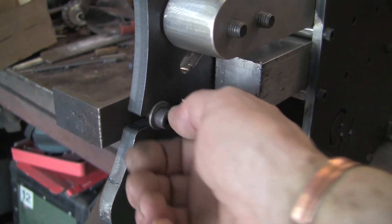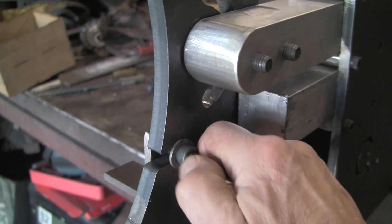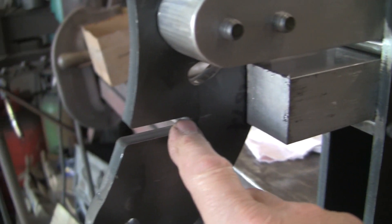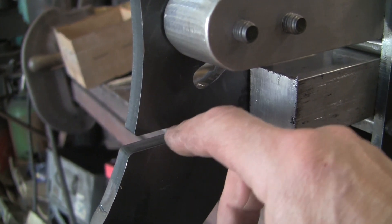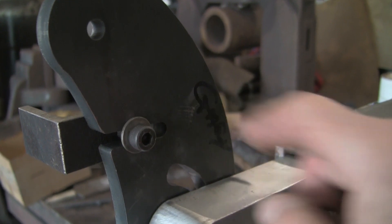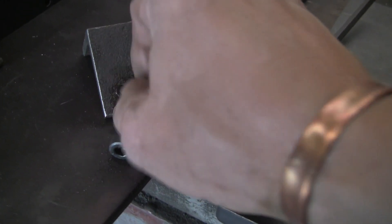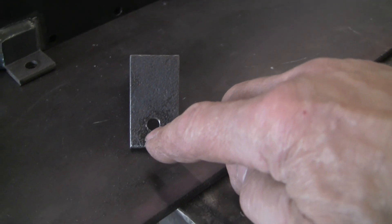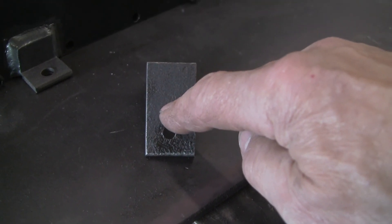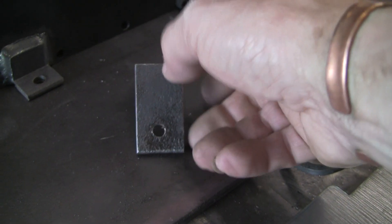What we'll do - I'm going to remove these and fill them in, just weld them up. I'll put a little bit of bar in there and weld them up, both of them. And then on these, instead of that, we'll put a slot in there. We'll put a bigger hole back here at 8mm clearance and slot that.